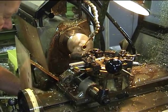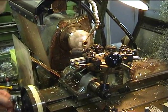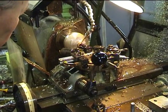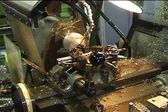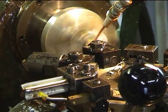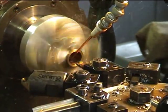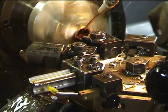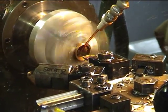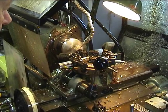The next tool is a large boring bar which will remove a large bulk of material in that crankcase. I'll just set the tool position to start with. There's a large amount of material in there, so I need to take two or three passes — not that the machine couldn't take off all that material in one pass, but you have to consider the strength of the crankcase and the fixture holding it. I'll take another pass, and yet another pass. This pass is very close to the finished diameter or bore of the crankcase.